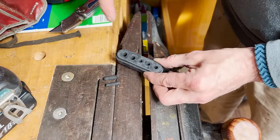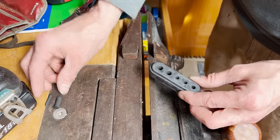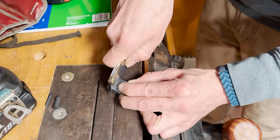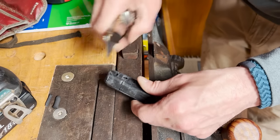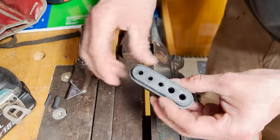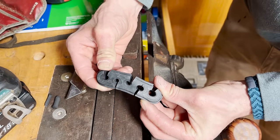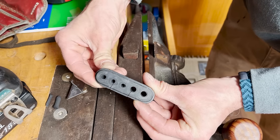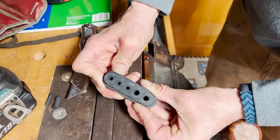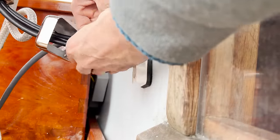So I can't get the ends of the cables through because they have fittings on them. So it's going to seem crazy, but the solution to that is to cut in from the side. And we'll go fit that around some cables. And then when this gland gets all squished and tightened down, the rubber will essentially self-seal and the water won't be able to get through. It's a pretty nifty little rig.